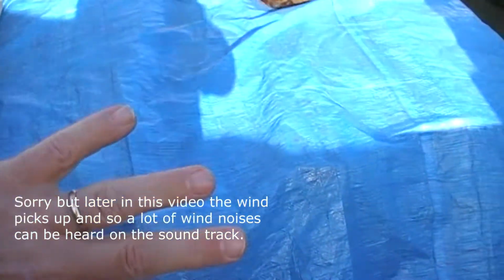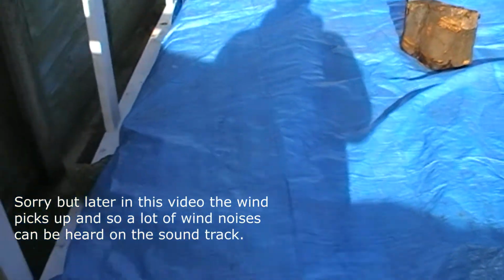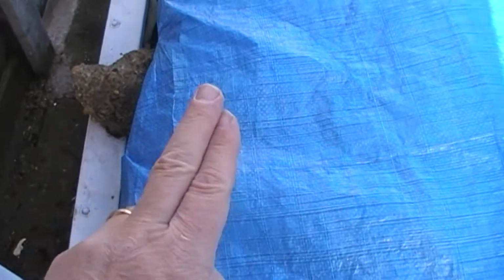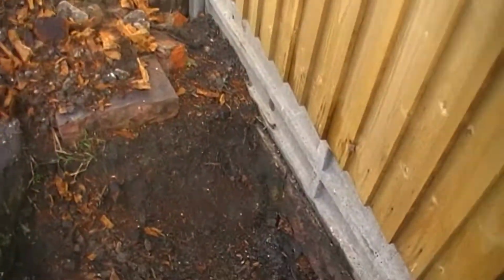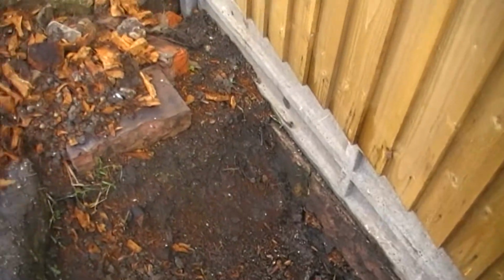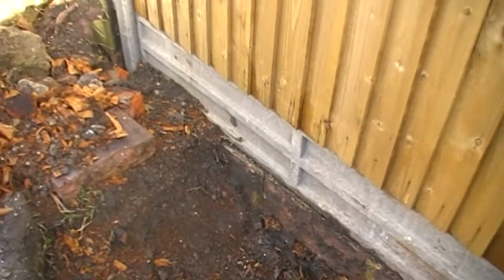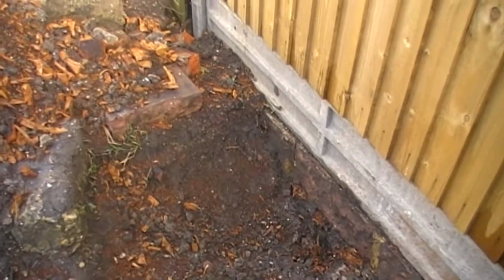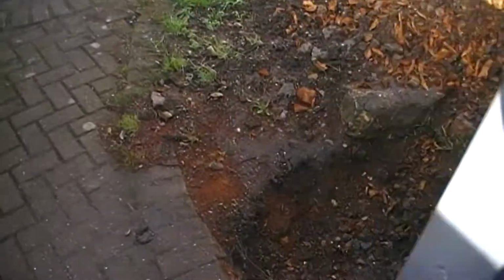First of all, move this a bit further that direction so that I can get at the bit down here, the concrete underneath. I need to then carve a hole down and through that way, which will then come out about where that bit of dirt is over there, and it needs to be underneath this gravel board. This is for the water pipes. They're going to go into the shed, for the sink. I also need the waste, but the waste has to be a bit higher. It's going to come through.